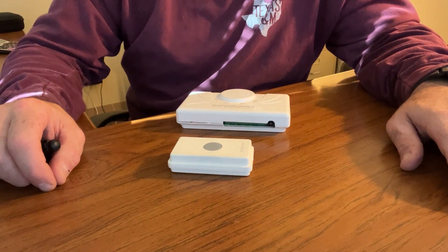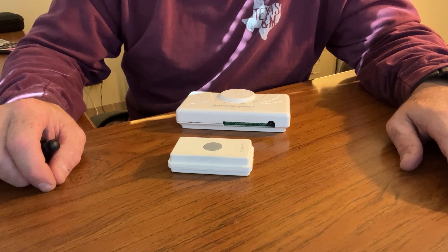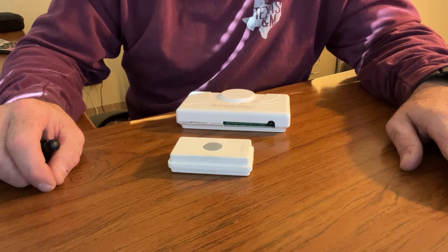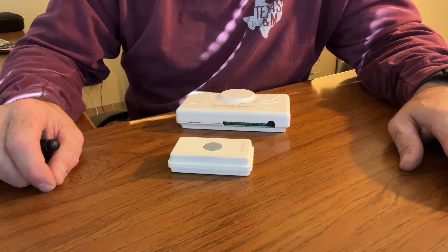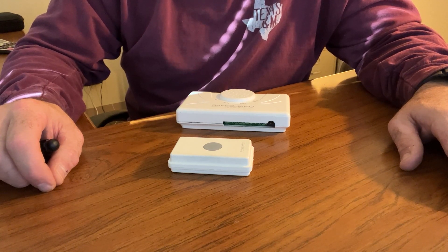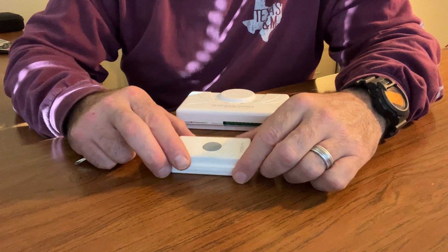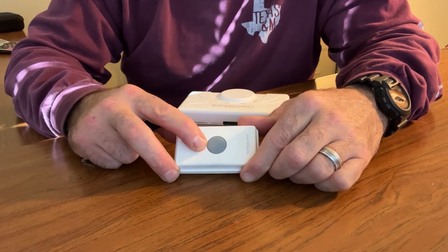We're not going to go over the specifics of the other receivers and transmitters here — consult the specific user manuals for details, including how to install a battery. The basic programming is the same on all receiver types and push buttons, with some nuances on how to put it into programming mode and how to trigger the transmitter. When I talk about triggering the transmitter, in this case it's pushing the center button — notice the red LED illuminates, meaning it is transmitting a radio signal.